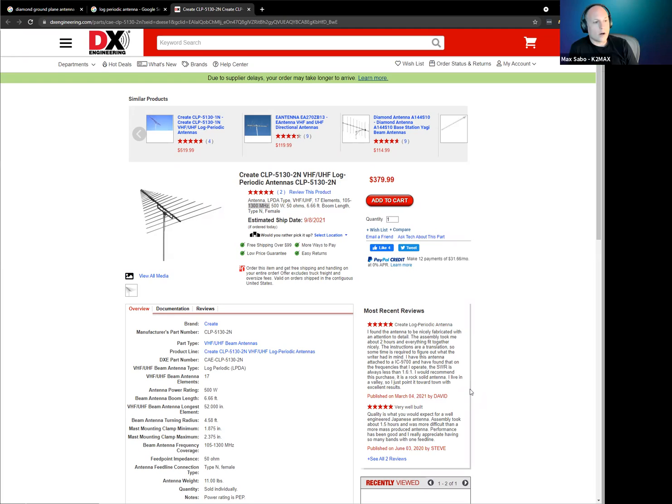So now, did you have an interesting antenna to set up? Oh, I was just going to ask, when you transmitted on it, did you have to tune the antenna every time you changed bands significantly? Yeah, our equipment actually auto-tuned. It had a coil with a roller in the power amplifier that automatically tuned to the frequency. And because it's such a wide band antenna, you would need to retune if you went too far up or down the band from where you were transmitting last.